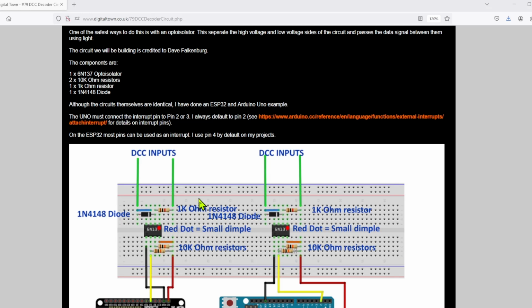As usual, I've done a reference page for this project on the Digital Town website. There'll be a link below the video. The items you need are a 6N137 opto-isolator, a pair of 10K resistors, a 1K resistor, and a 1N4148 diode. Now I'm going to be honest, these particular items are so cheap that there's no difference between buying one and buying 100. So I just buy them in packs of 100 or 50 if they're a few pennies cheaper. I've got bag loads of them. The opto isolators, I think the first link I went on, it was 5 for £1.30. So again, very, very cheap items.